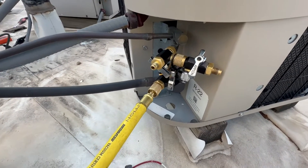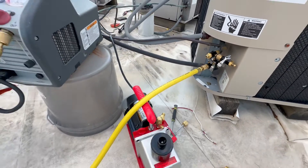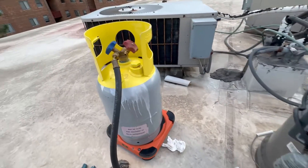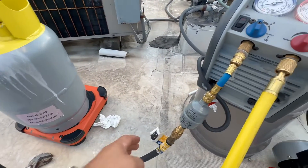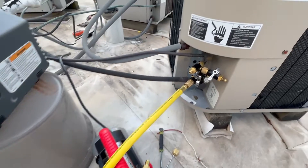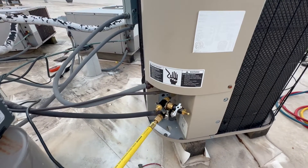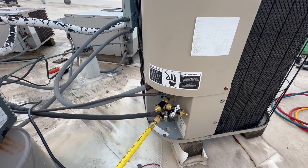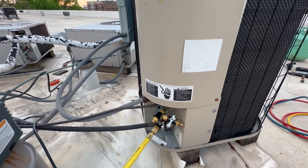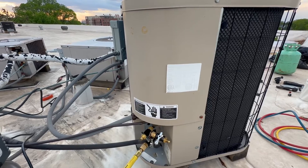Before we start the process, let's talk about it. Why am I doing this? Because we don't have power here at this unit — they are rehabbing the apartment downstairs. I usually do it with the help of the compressor of the condenser, but we don't have power, so we're gonna use the recovery machine. We're gonna hook it to another unit to get 110V. It won't hurt anything — the recovery machine is just a machine to transfer refrigerant; it doesn't know where it's going. So we're just gonna reverse it and put refrigerant from the tank to the condenser.